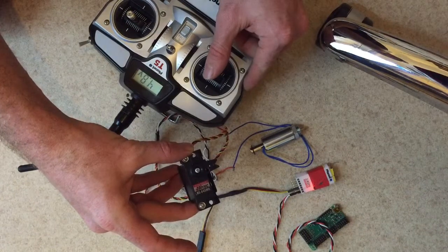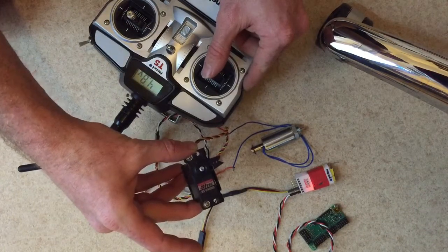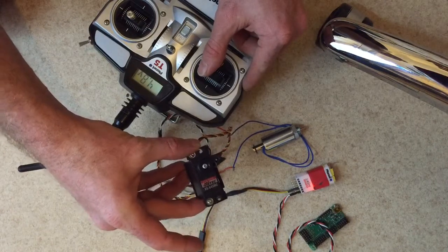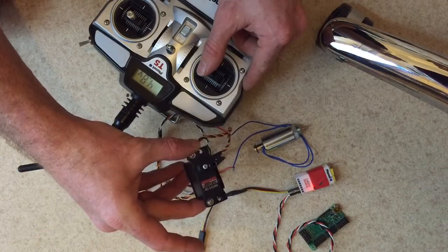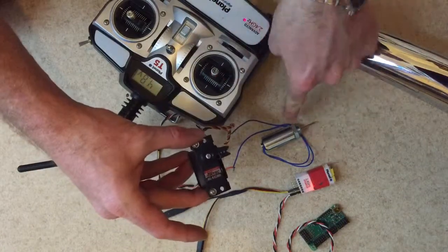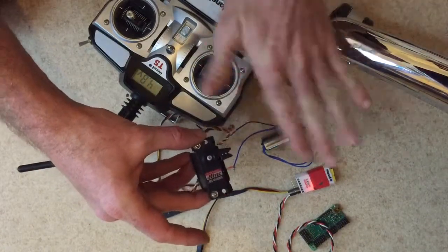Can you see that? Can you see how slow that is? Because I'm adjusting it slowly. See, watch the solenoid on the floor. See how that's slowly going in? There can never be a time in which that is slowly going in. It needs to be 100% on or 100% off, no in between.